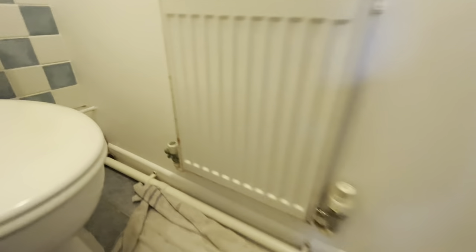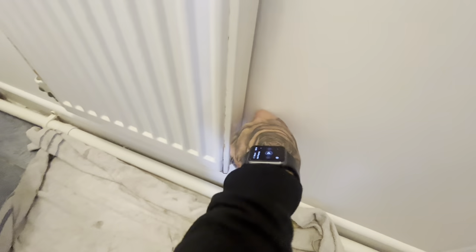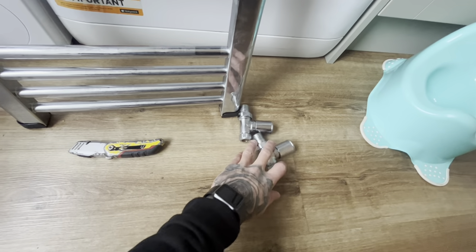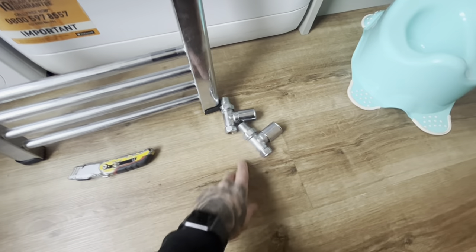This is what we've got to take off. As usual, get both valves shut off and drain the radiator. We're replacing it with this - it's upside down obviously - straight valves and chrome 10 to 15 mil elbows. With rapid blue, we're going to risk it again.